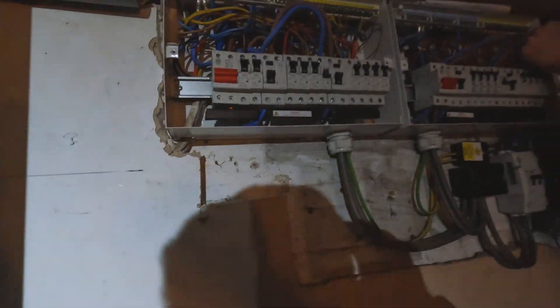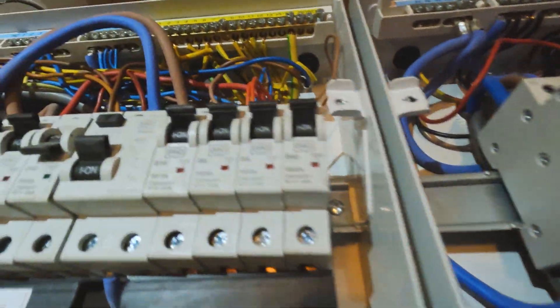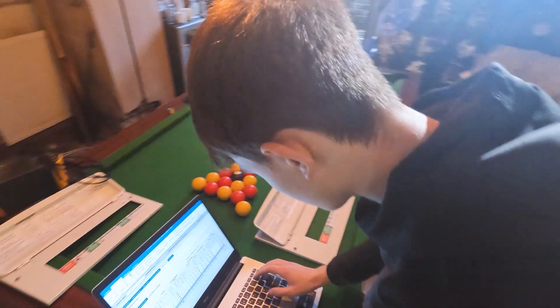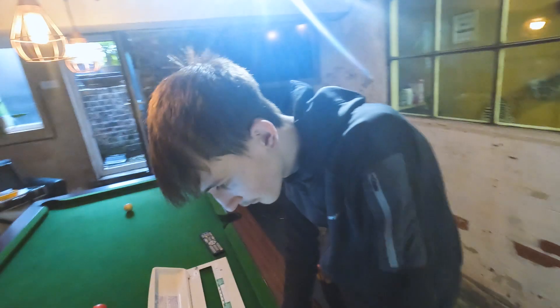Let's have a look in here - do a little inspection. This side - grommeted, grommeted, grommeted - and then what's that? Not grommeted! So he's found it. That'll have to go down - fuse board DB1, no grommets in top of fuse board, needs grommeting. Ellis is typing away writing out the details for these circuits. What we'll do is show a radial test and then a ring test.